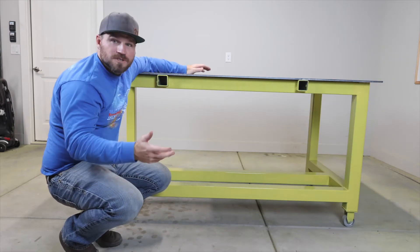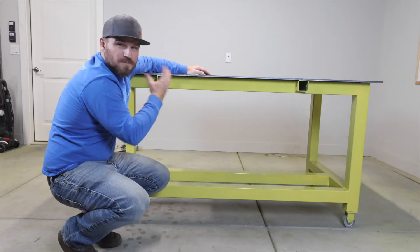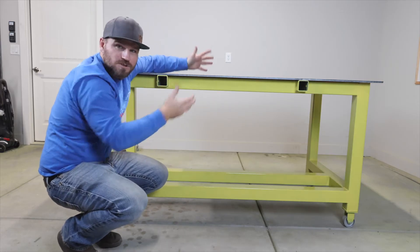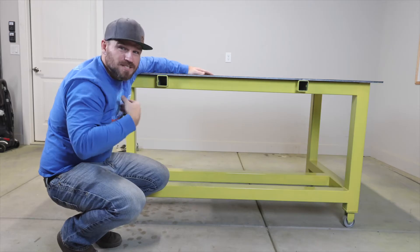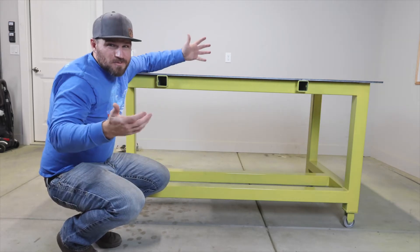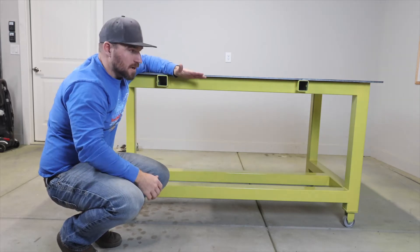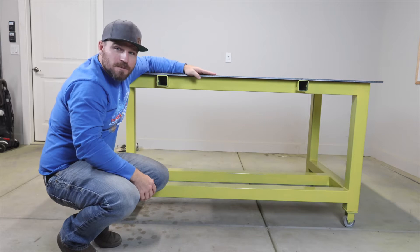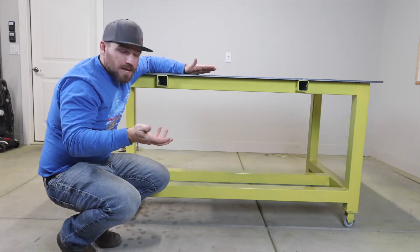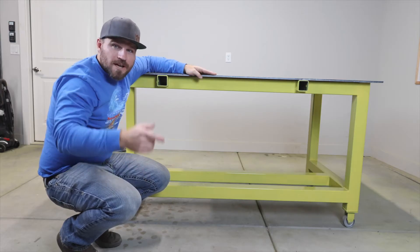Once all those accessories are built, I'm going to build a whole racking system underneath made out of receiver hitches so I can slide them all in and they'll be stored really nicely. I have a size issue, which is why I've made this table smaller than 4 by 8 — I need to be able to pull a truck into my garage. The overall height of the table is 36 inches, which I personally feel is the perfect working height. And ultimately that's everything you need to know, so let's go ahead and start building.